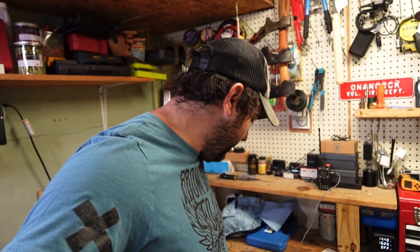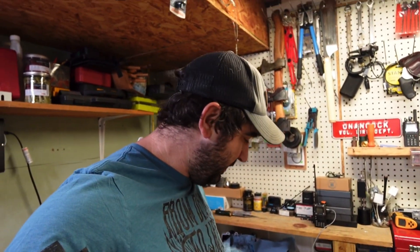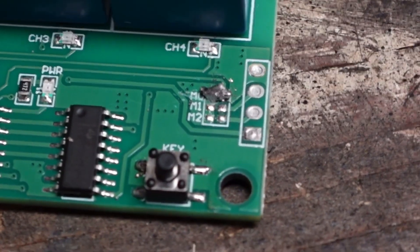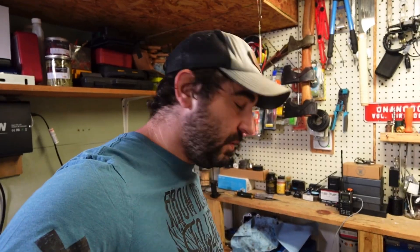About three minutes later, we got it done. I literally just took a piece of wire, stripped it back, and cut off a section about as long as I wanted. I tinned it real quick before I cut it, cut it to the length I wanted, laid it on there, and basically just let it reheat — and it sat right down, soldered in place. I am not an expert at soldering, but there it is. Looks terrible, but should function just like we want.